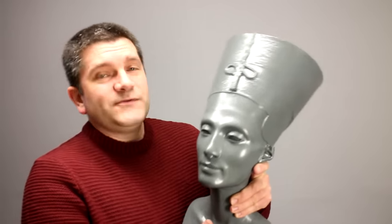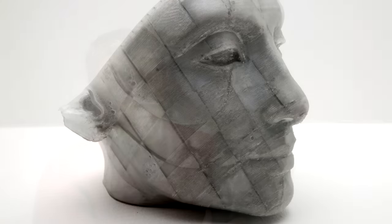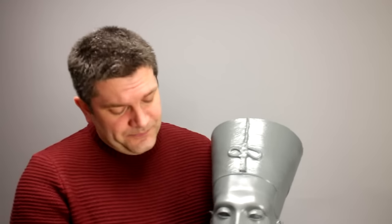The top two sections were completely hollow — this left and right side are just spiral vase printed, completely utterly hollow with only an outer wall, and this is where you get all of that wonderful detail. The face has got around 6% to 8% infill — very, very low — just a rectilinear infill with a single wall outline. The base again is exactly the same, about 6% to 8% infill.